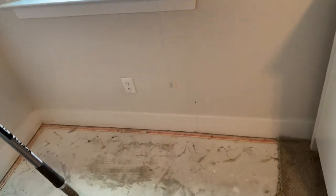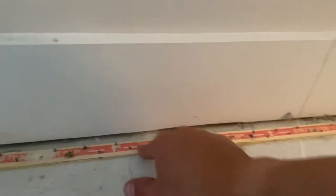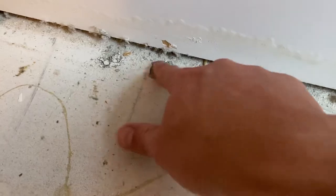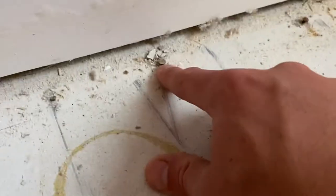You're going to have these nasty old tack strips. A tack strip can either be nailed down — this one is nailed into the concrete — and I really hate when this happens, because in order to pull this tack strip out I have to rip some of the concrete up, which creates kind of a bullet hole effect right there.